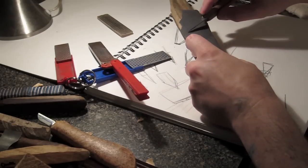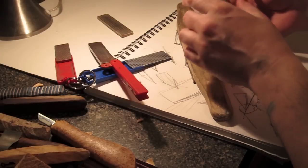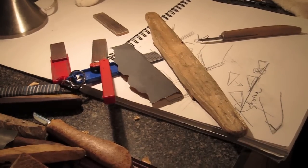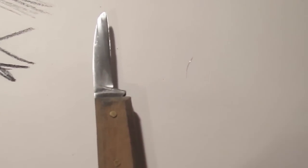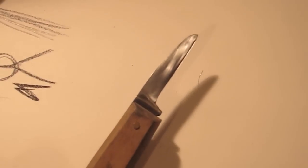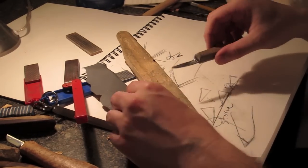Get packs of 600, 800, 1000, 1500 — if there's anything higher, grab that, and you're doing great sharpening from there. Sandpaper fills up faster, which also means you can kind of move along the grits by staying in one spot, then going back to a used spot to polish it up. At this point I can see something in my lighting — and of course one of my cats makes an appearance. But we get a great shot of the burr happening, a nice flat bevel, and you can even see a little piece of burr that fell off like a tiny metal hair.